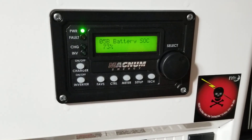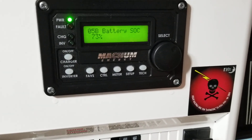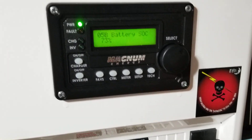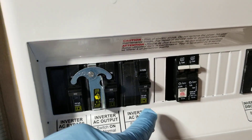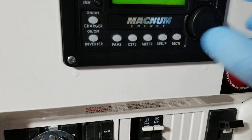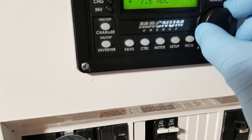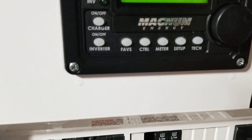You can see the charge controller just came up from fault mode — it was at 24.4 volts when the system cut off, and now we're charging the batteries. Power is disconnected, we shut it off, and we're charging. We can see from the Battery Monitor Kit, the BMK, that we're adding about 7.6 amps total to the system.